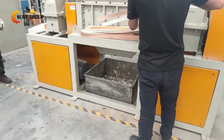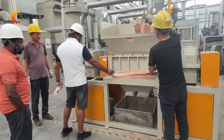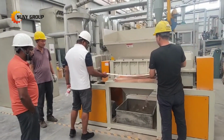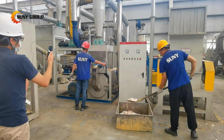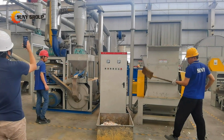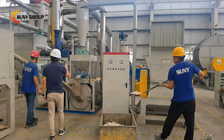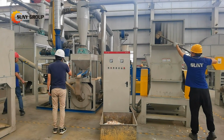During the recycling process of waste circuit boards, it is generally necessary to remove the electronic components on top, separately crush and sort the motherboards, and then classify and process the components. Therefore, we use CCL instead of the circuit board motherboards for the recycling process, primarily to separate metals and non-metallic resins.